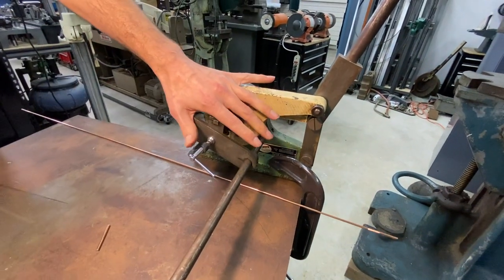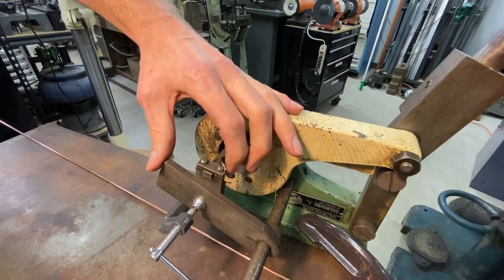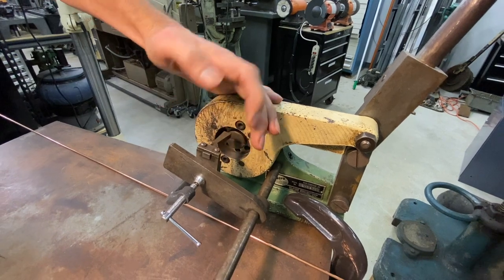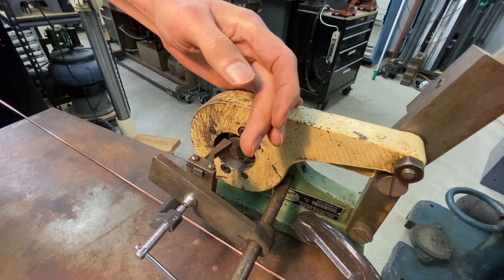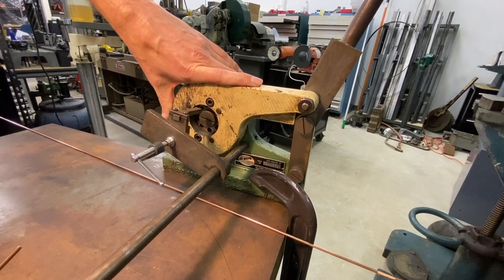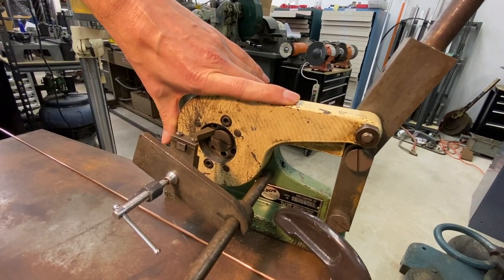One important thing to remember is to not cut hard materials with these. So no spring steel. I would not really do much stainless, or if you do, be careful what the hardness is. It's made for softer materials. Cold roll steels, brass, aluminum, plastics, things like that. Kind of think of it as whatever you would cut with a high speed end mill is the only thing you'd want to put through this machine.